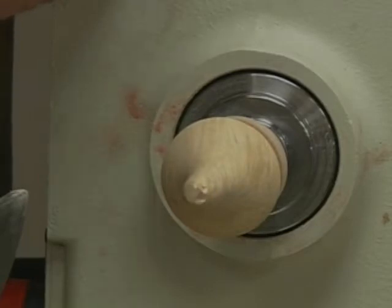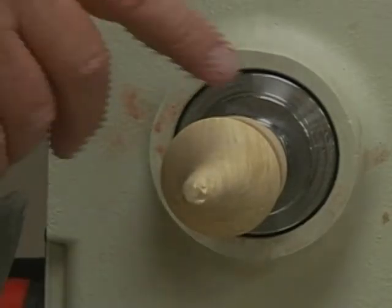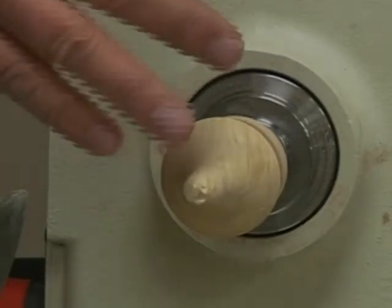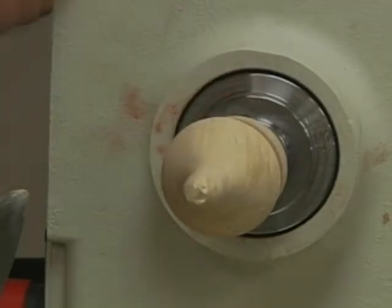And believe me, you have to do it a step at a time or they're not going to come out. One side will be wider than another. If you think you're going to put this all together and then put it on as a unit, it doesn't seem to work. Once I had my ebony where I wanted it, I would do a piece of holly the same way and bring it down to whatever thickness I wanted.